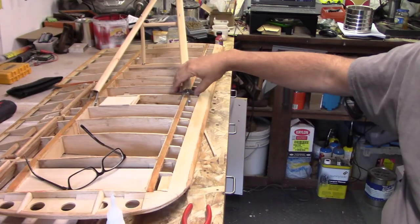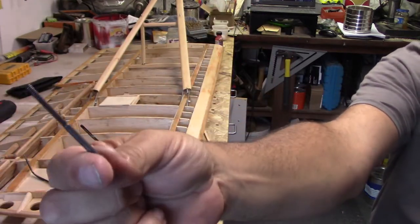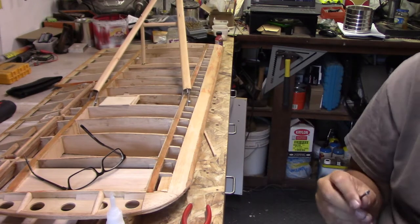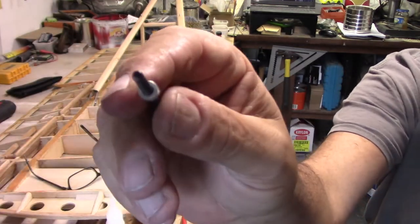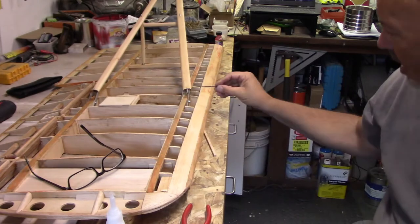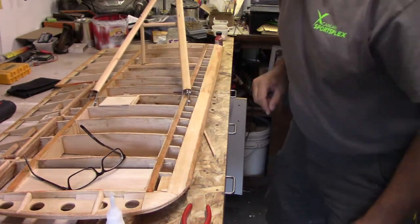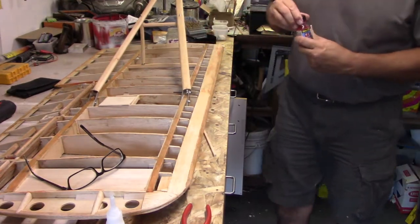Right now I'm trying to modify the connectors so that I can use these little 632 Allens with a long shoulder on it. And what I'm doing right now is, almost dropped it. I'm making little aluminum spacers. Let me get it back here. Little aluminum spacers that are gonna slide on here first. Then it's gonna go through. And then there's gonna be another little spacer on the other side, just so that I've got some thread that I can put a lock nut onto.